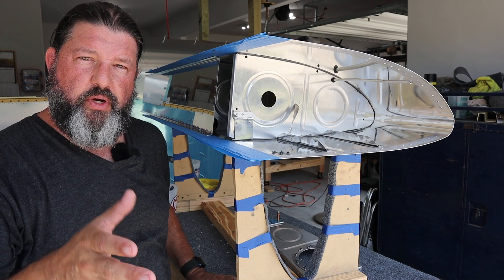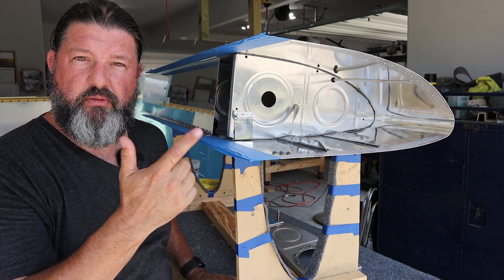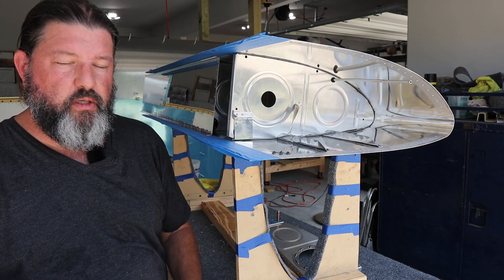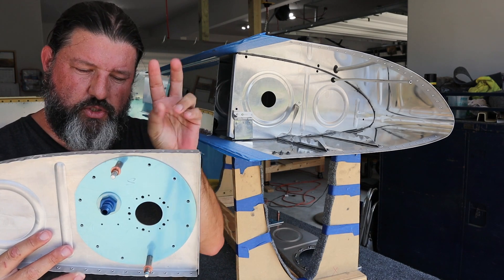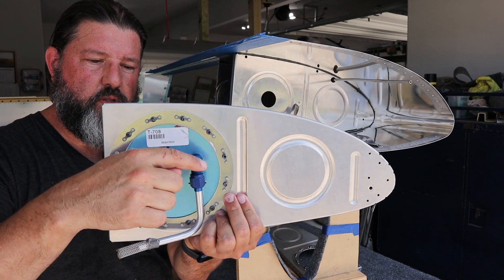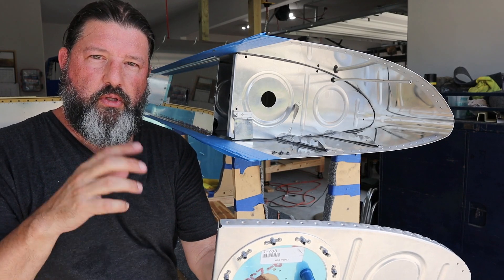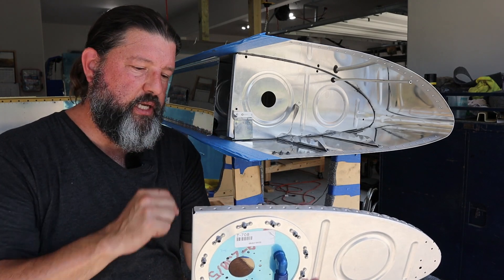So Raphael asked if I could give a better explanation of inverted fuel, and I'm going to do my best unscripted. To begin with, I'll show you what 99% of planes out there use for the fuel system. This is the root rib for the right wing — it's going to be traditional. On the back of this access plate you can see the fuel pickup: a hard aluminum line with a little mesh basket on the end, sitting at the very lowest part of the fuel tank to hopefully get every last drop of fuel.